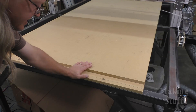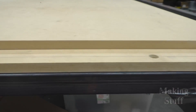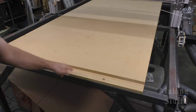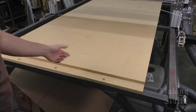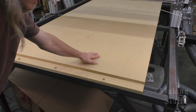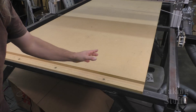So here is my first problem. It's this MDF. It wants to move around on me even though I've got the bottom layer bolted to the frame of the machine. This top layer is just sitting here and I need to fasten it to this bottom layer somehow. I thought about putting screws through the top layer of MDF into the bottom layer, but that presents things that a router bit could hit when I make a mistake, even if I countersink it. So I'm going to glue this top layer to the bottom layer and hopefully that will keep this MDF from moving around with temperature and humidity changes.